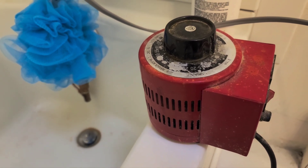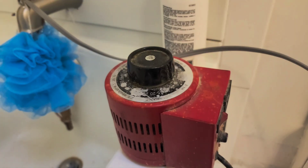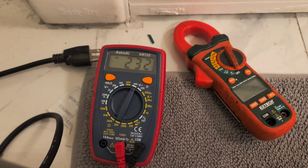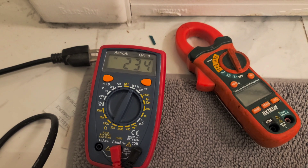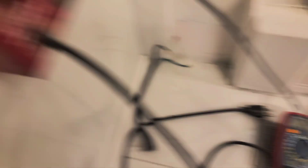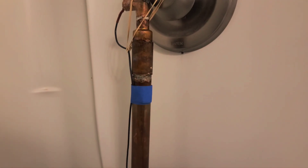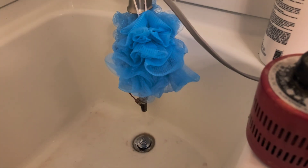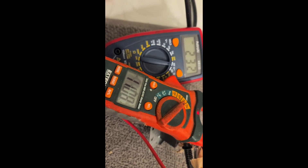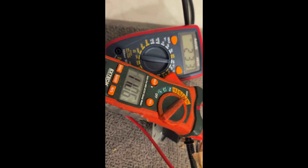Let's go up to 2800 watts. I definitely thought it'd break by now so I could take it apart and see what went wrong. It's been some time, but that's almost 240 — 235 volts. I am scared to touch it. We'll see how long it lasts; if it breaks, we'll see what went wrong. That's 11 amps at 235 volts — that's 2800 watts.